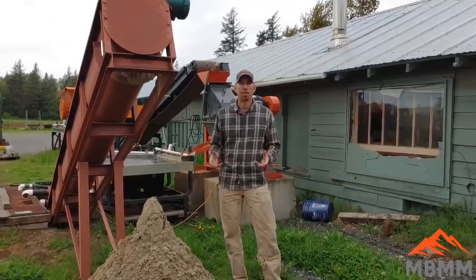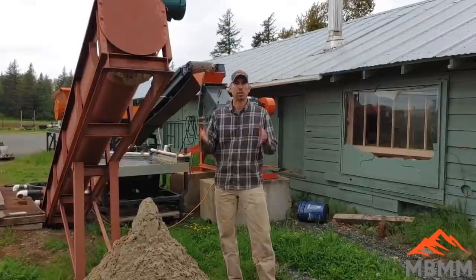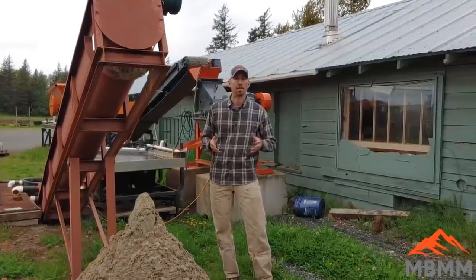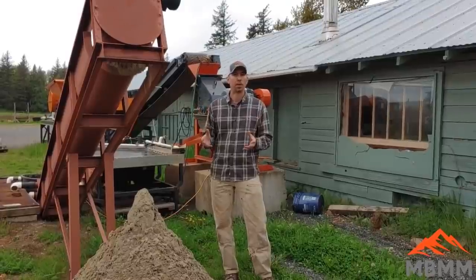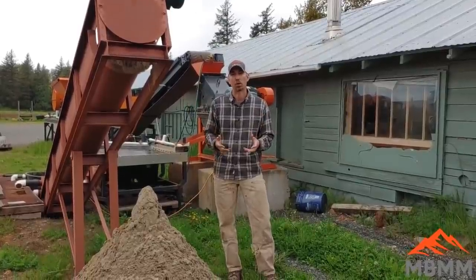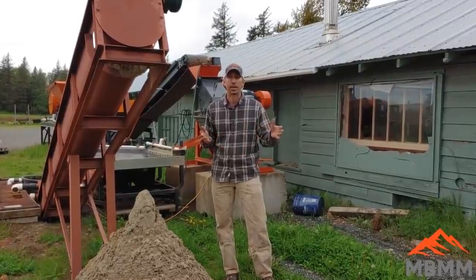One of the really important parts to understand as an operator or a bulk sampler of a gold claim is your goal is not to initially recover as much gold as you can. Your goal is to get the information you need to go for the next step for investing in machinery. And so that's why we did our grind size analysis. With the hammer mill and the system as it is, we're recovering about 75% of the gold. But we found out that if you can grind to 100 mesh minus, you can recover somewhere in the 90%